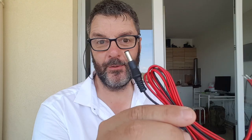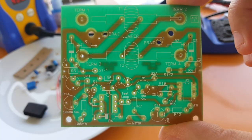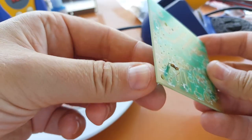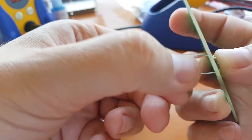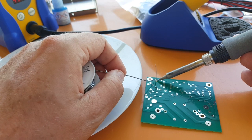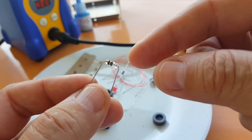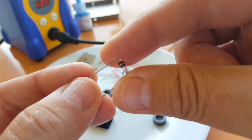It does come with a printed manual, which is kind of cool — it wastes a little bit of paper but it does help. They even give you a power cable, which is great. Nothing like a white plate for components, and there aren't that many of them. The markings on the board are very clear, which always helps. You have to be very careful with the 1N34A diodes because they're made of glass and can break very easily, so when you bend the leads, do it very gently.